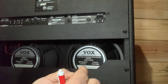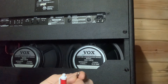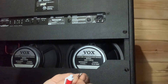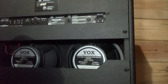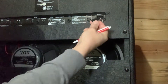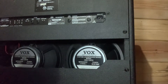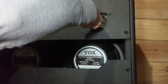Let me see if I can read it — it's a 3-amp, 250-volt fuse, so it's a tiny little fuse. Obviously I'm going to have to get more of those because I've now used the two that I had. The research I've done says that when this fuse keeps blowing, it's going to be your rectifier tubes.